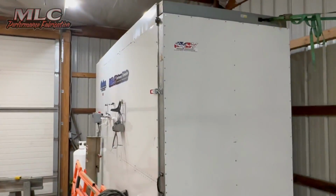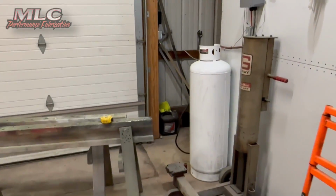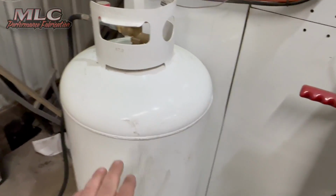And I think right now I'm sitting with the tank, and this one came from Tractor Supply. 100-pound tank. What we found on that tank, we filled it up last time completely full, so we had the 24, 25 gallons, whatever goes in that thing. We ran it, and I took it to fill it up today, and I put 18.1 gallons in it. And we had it charted out on the wall. We've been keeping track of the time on it, which we had 12 hours on that 18 gallons. Not bad.